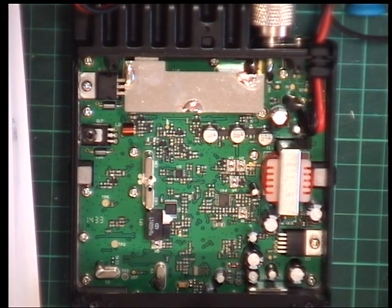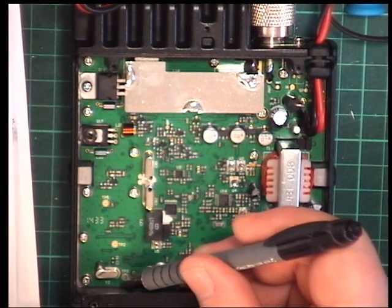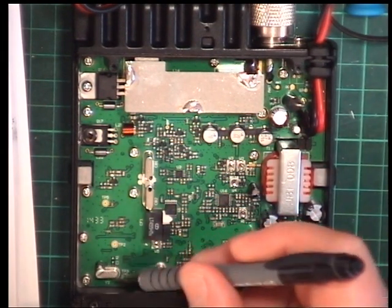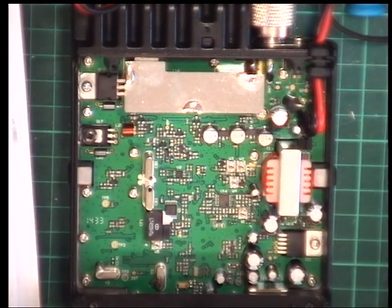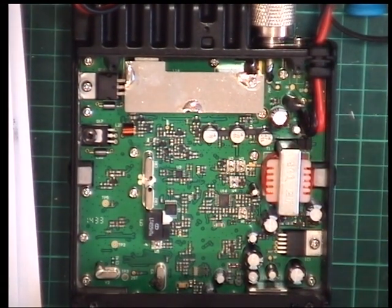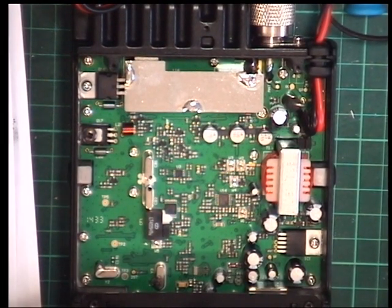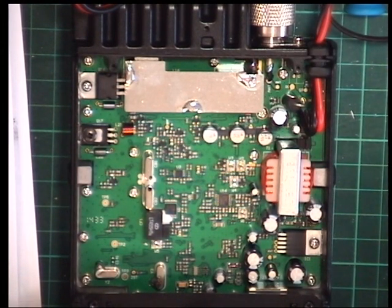So straight away there's something I don't like, and that is that we've got the 10.24 crystal just there, the reference crystal, and it's not adjustable frequency wise, so it's either on frequency or it's not on frequency, and that's not something I like. The old Uniden audio line series of sets from 81 played that game. But having said that, 38 years later, they're still mostly not off frequency that much to have to do anything about it.